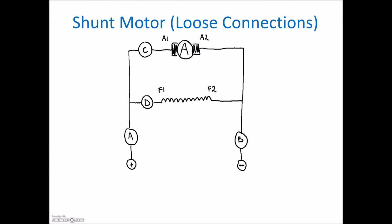We're going to create some loose connections on a shunt DC motor. I have a loose connection at my positive supply. Next I'm going to do a loose connection on my negative supply, then I'm going to kill current going to the armature, and finally I'm going to kill current going to the shunt. At each individual spot, pause the video and figure out whether the motor is going to come to a complete stop or lose its mind and go faster and faster.